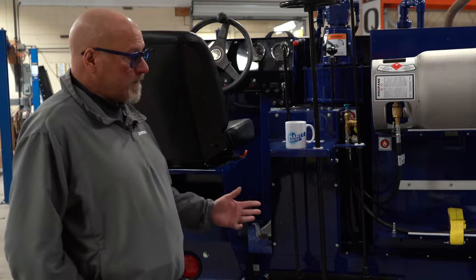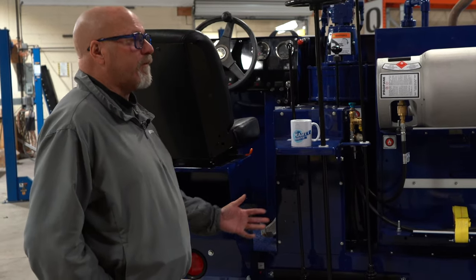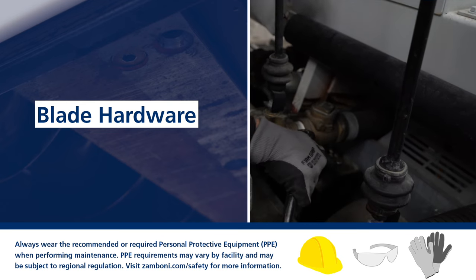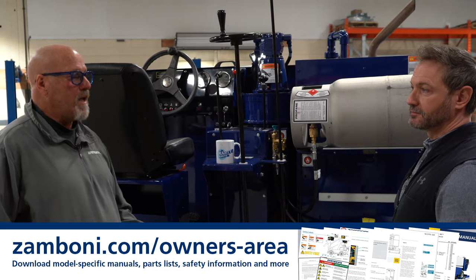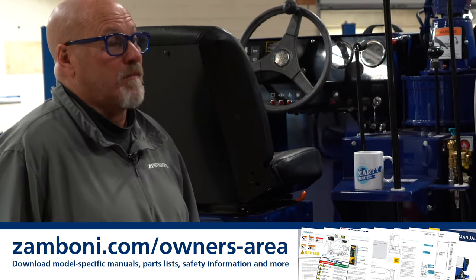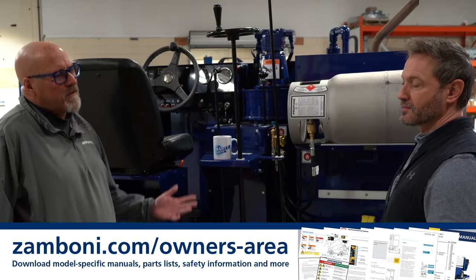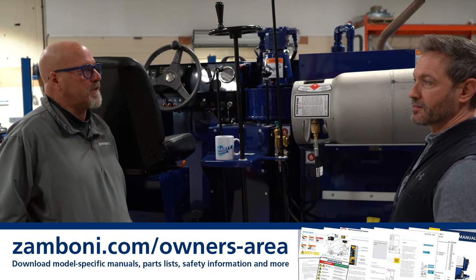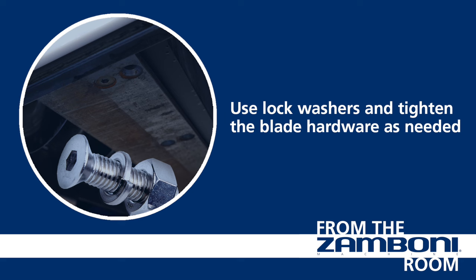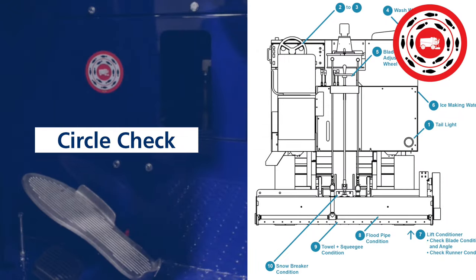The second thing is the hardware, specifically for your blade. Is the hardware tightened properly? Do you have loose hardware? Are you inspecting that? You just can't change a blade once a week and trust that your hardware is still at its proper 20-pound torque. Something might have loosened off. So those are the first couple of things I would be asking the customer — how fast are you driving, and are you making sure you check your hardware on your blade to make sure your lock washers and nuts are still tight at 20-pound torque?